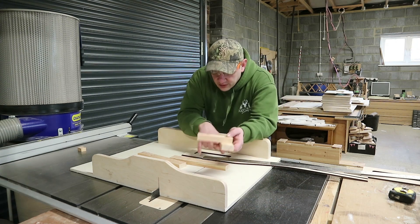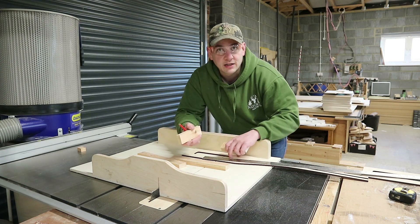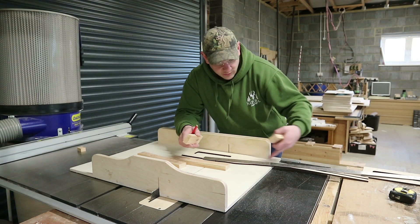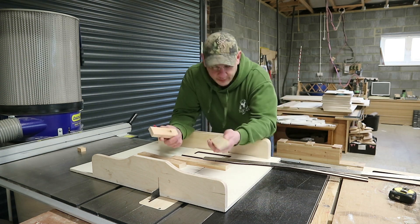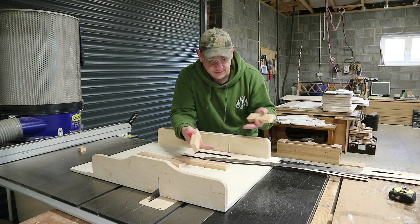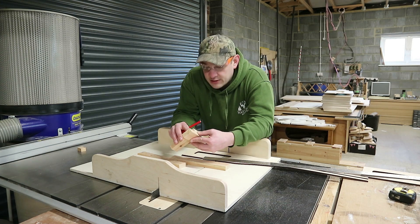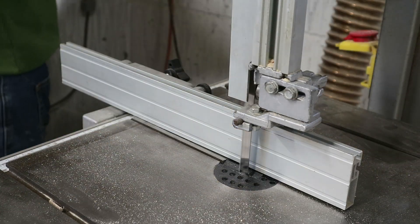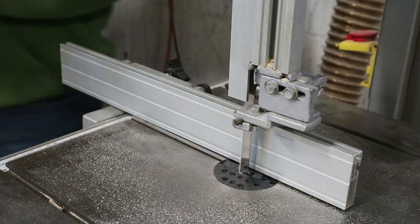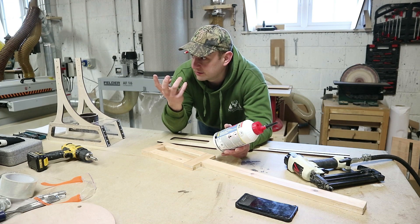I want all of these to lap — so both ends are going to be lap joints. In the center there's going to be a single piece that goes up here, and I want that to lap into the cross brace going along this section. Then that will all tie in and be sandwiched between these two pieces — 6mm birch with some polyurethane glue. It's going to be mega strong, and that's what we need. Glue it and nail it, get it all sandwiched together, and then we can get moving.